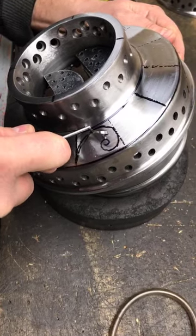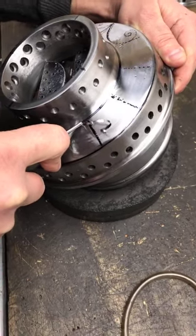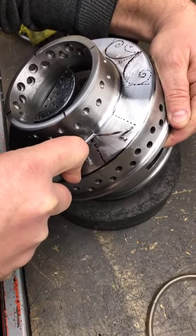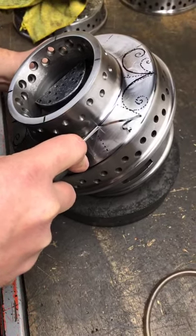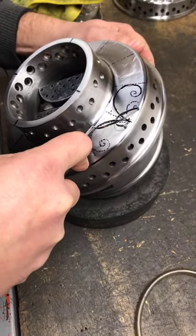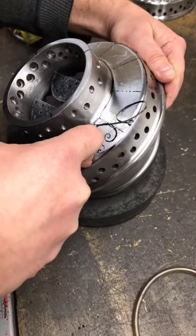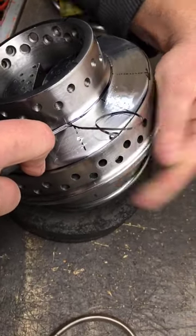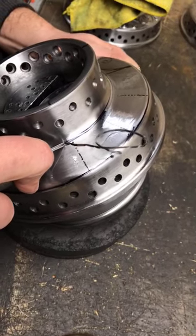Usually the marker should not erase, but if it erases, you have to clean it all up and redo it, unless you can follow a broken up pattern. And this is what I talk about, no chicken scratch. It's not a really thin line. It's really deep or wide, and it's continuous. That's what makes the lines cleaner for when the product is actually chromed with a high quality triple plated show chrome.